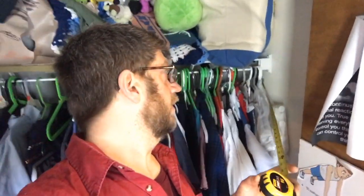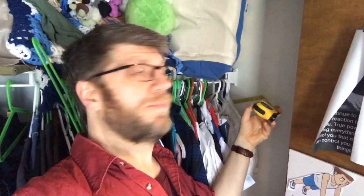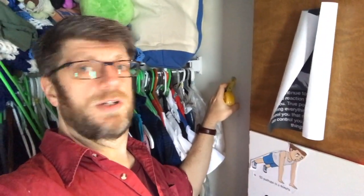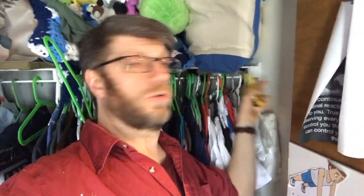I'm going to start prepping some wood - I've got my painting shirt on. First things first, I'm taking measurements. The clothing bar needs to be 12 inches off the back wall - that's important so hangers fit correctly. I'll test with adult hangers. The closet depth is 28 inches, also important. Since this is just drywall and sheetrock, I don't know where the studs are, and the chances of studs lining up with my 12-inch mark are slim to none.